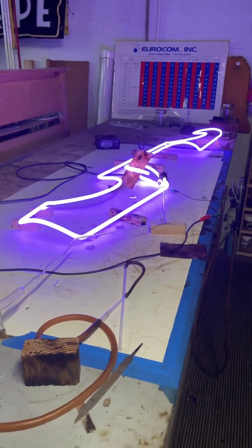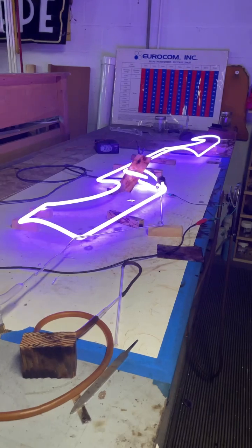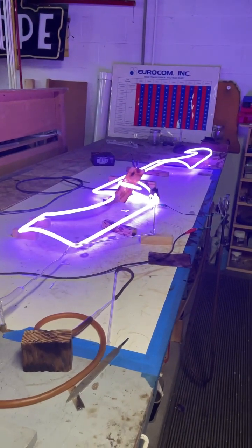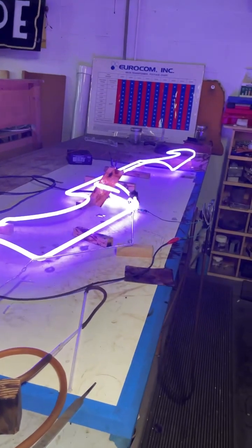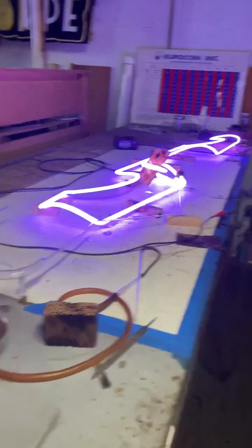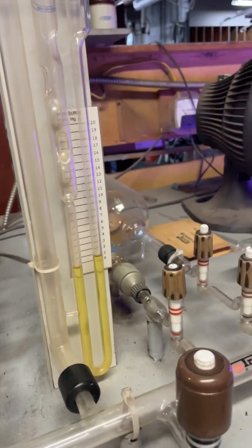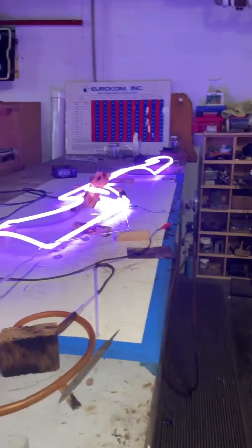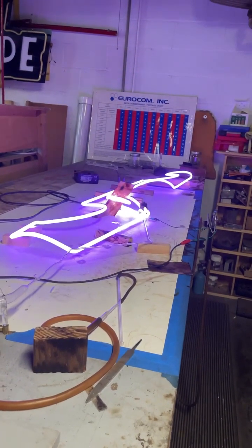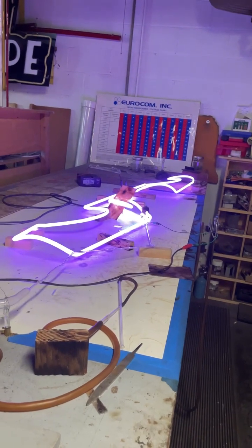See how much more consistent? I'm not having to turn it off and suck out some of the impurities. We're about back up to 100. I'm gonna raise my amps. Got a lot of the impurities out in that first heat up, because my fluid would rise when the impurities start to form. It's gonna rise again for sure. We're at 104. We got to get this thing hotter.